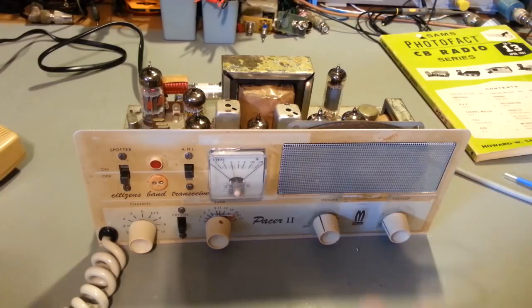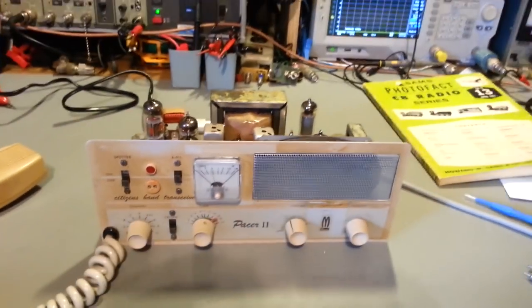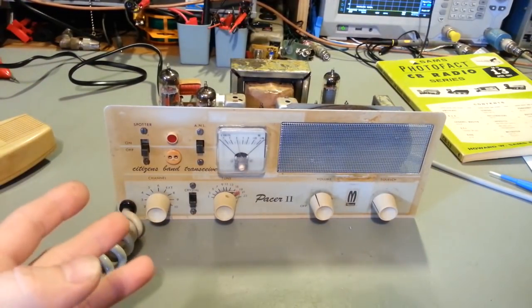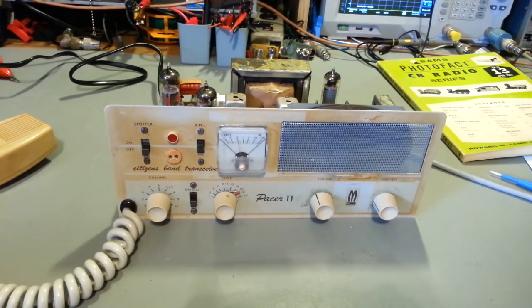But, yeah, this would be my next favorite, is the squelch in a tube-type radio, because, like I say, it kind of fades in and out. It's not instant on and off. But there you go. There is a radio that needed some help, like I say, a cap job. A couple caps got replaced that I didn't need to. Now, of course, I'm not going to charge the customer for those three, I think it was.